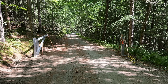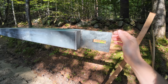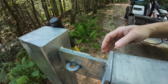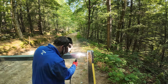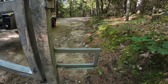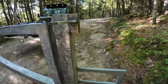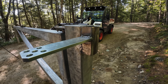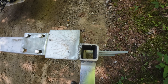The end of this gate is actually customizable — some people might need only 14 or 12 feet and can cut off the end. In my case I'm using it at its max, so I had to weld the end cap in position using simple tack welds. Next I added a support frame welded directly to the post to hold my control cabinet, and I added a 2-inch by 2-inch piece of steel to support one of the hinge brackets for the opener. This point is dictated by the directions, and you'll see how I use it for a camera later.